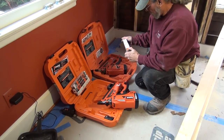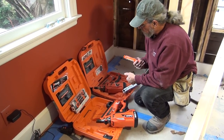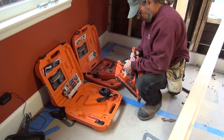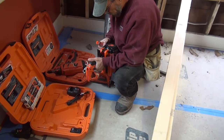It always seemed to be way too much work and time on small jobs, so I went to cordless — cordless gas-powered nailers. They helped me bridge that gap, and because of that I leaned heavily on Paslode gas nailers for many, many years. Cordless nailers do have their drawbacks: they're slower firing, they require regular maintenance, cold temperatures affect them, and the cost of the cartridges amortized over the life of the tool adds up a lot.